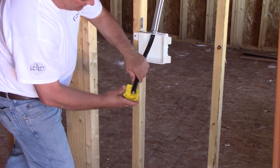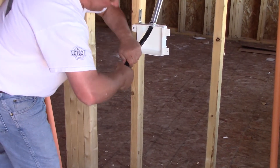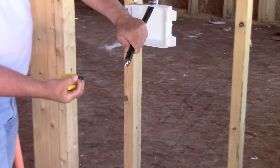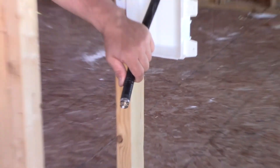All three layers have been removed. Take the debris out of the stripping tool and turn it around to side two. Same thing — go to the dead-end stop, close it down, rotate it, then pull straight off. If it gets stuck, you can simply peel that little piece of jacket right off, and we have it exposed. Second valley back, we have the mesh, and we're ready to make the fitting assembly.